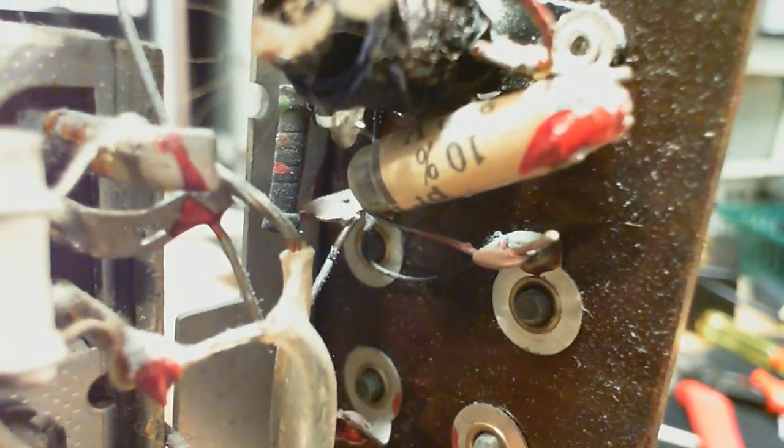Oh, this looks familiar. Last radio I had trouble right in an area like this. Look at that little capacitor there. How many of those are in here? That particular type, I think. No, that's a reliable type, I believe. Look, they used 300 ohm wire just to shoot this 1 inch from the back of that to the front of this. They thought that was worthwhile doing that.